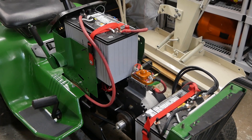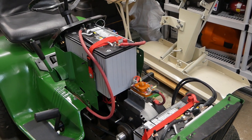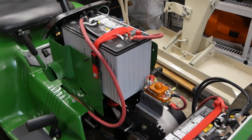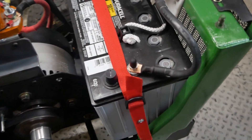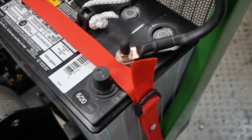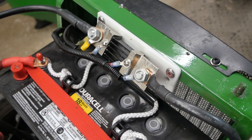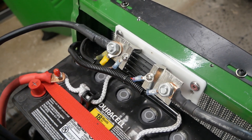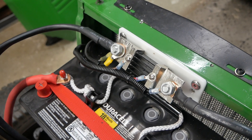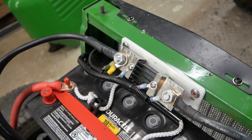So let's talk about how it's wired. Obviously we have positive and negative — three 12 volt AGM 105 amp hour deep cycle batteries. Starting at the negative: from battery number two's negative post, we run a piece of 1-gauge wire up to a shunt. This shunt sends information to a battery monitor to let me know how many amp hours I have, how many I'm using, how many I have left, battery voltage, amps, etc.